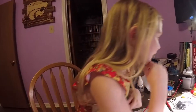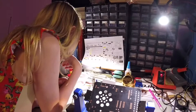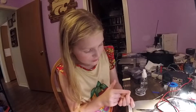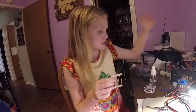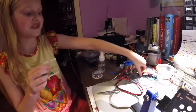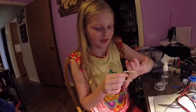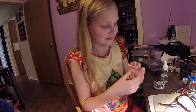What's the first component we're going to install? Let's see — it says resistor. These are all in order, one through seven. So we measured them all using our volt ohmmeter with the probes, and we found out the manufacturer was kind enough to put them in order. So now we're going to cut them out and stuff them on.